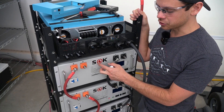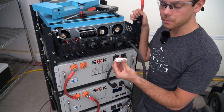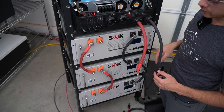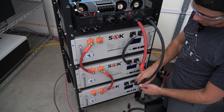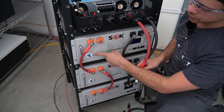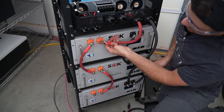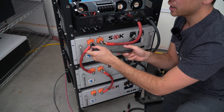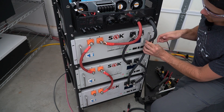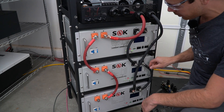These batteries have a pre-charge resistor circuit that you can enable by turning the unit off and then turning it back on again. It takes too much time — especially with three batteries — so I'm just going to do it manually with a two-dollar resistor. With all large inverters you want to attach the cables to the unit first and then attach to the battery second. Next, ensure that the batteries are turned on and then attach the resistor to charge up those capacitors. After you wait a few seconds you can connect it — and we had no spark. Then check all of your connections. Battery connections are very important and they cannot be loose. Always feel your connections to ensure they're nice and tight. It is so important to do this, and I do this every couple of weeks on all of my systems.